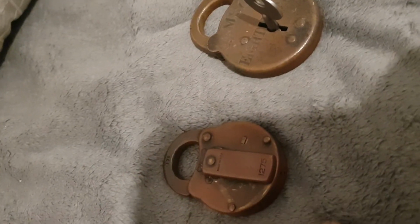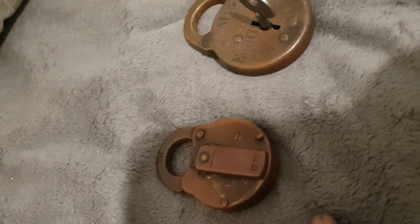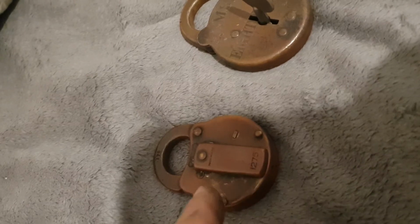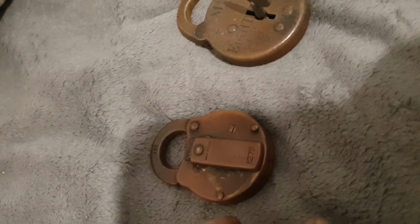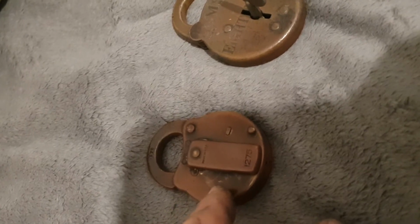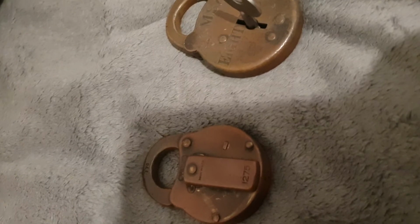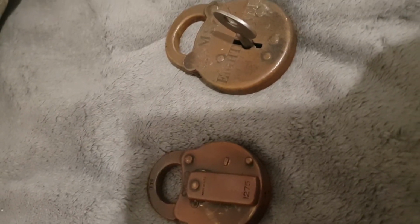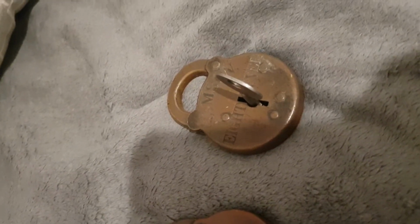So a lot of locks, people that hack into them, you'll find that the rivets just don't look factory. Inconsistency. Sometimes they'll restamp the rivets, and you'll see a little divot in the center of the rivet, and it just isn't factory. So you have to kind of get knowledge about what a factory rivet looks like on a particular lock, because they're going to vary to some degree.